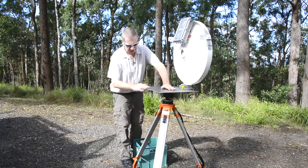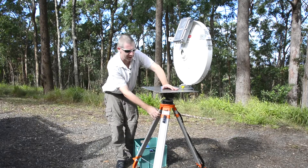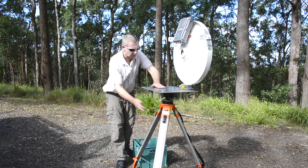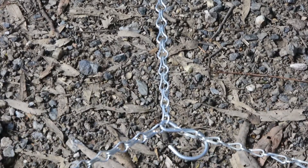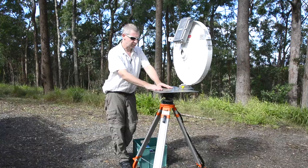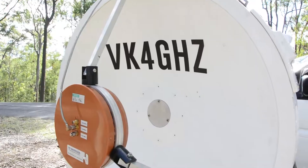So this is the new arrangement here. I've got a surveyor's tripod — these are quite affordable. Don't do what I did and go to Johnny Appleseed and pay $110 for them; they're $96 at Bunnings, and you can buy them from online stores for around the $40–$50 mark. They're very sturdy. I've just added a hanging basket chain across the three legs to prevent the 'oh shit' moment if the legs were to spread apart. I've got some tread plate on this which I've drilled and tapped a few holes into, and it mounts a dish at one side and just screws directly onto the pan and tilt head.